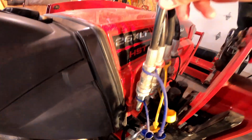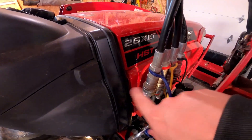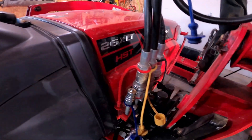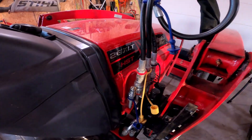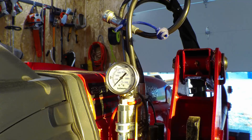To check this, get the hydraulics setup you need and install it on your tractor. I'm going to take off this front fitting — they're color-coded on the tractor, so you'll know. This front one is for my dump function on my loader. Make sure when you're doing this you keep all the fittings clean — you don't want dirt getting inside the hydraulic system. Taking that off, I'm going to put this new gauge on here. Some people use longer extension hoses depending on your application, but I didn't see the need to spend another $16 on a 16-inch section of hose.